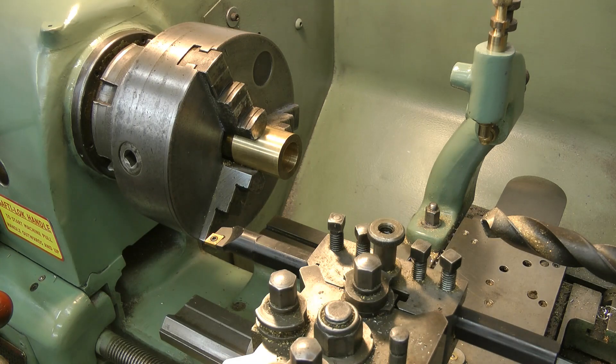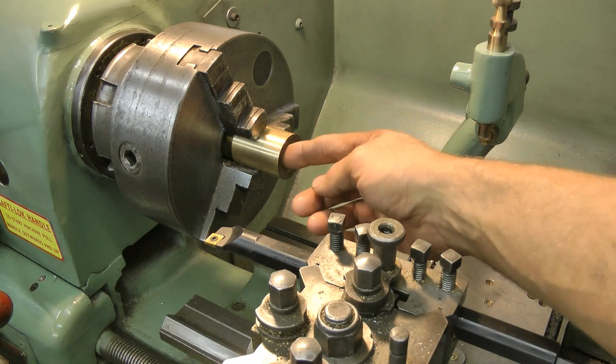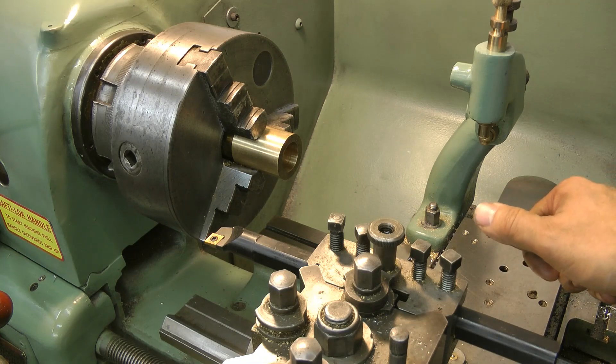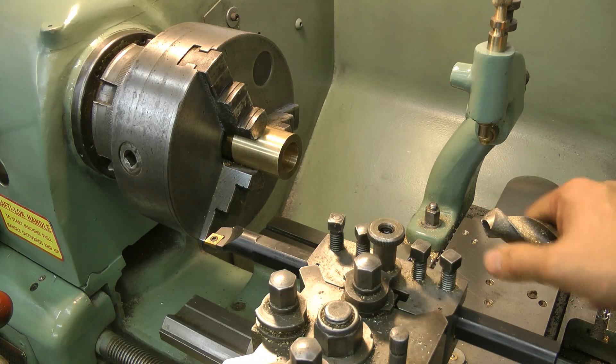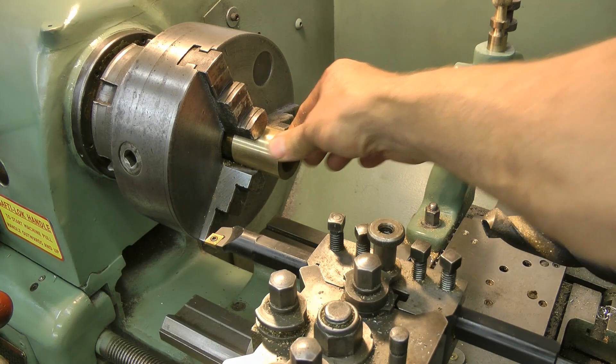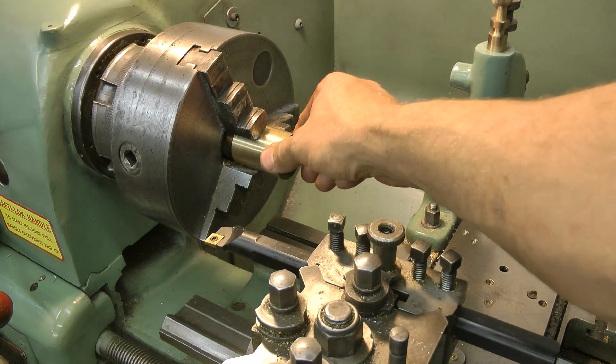Sorry, I just had to wait for the inverters to stop. I've now drilled a 26mm hole into the brass stock, and even at a lower speed of 300 RPM it's still very, very noisy. If you watched the last video, I presume it's just poor quality stock. Well, that's my excuse anyway. The next job is to bore a taper — that's what we're going to do.